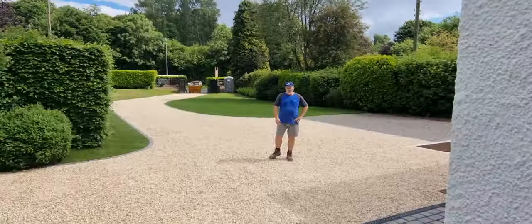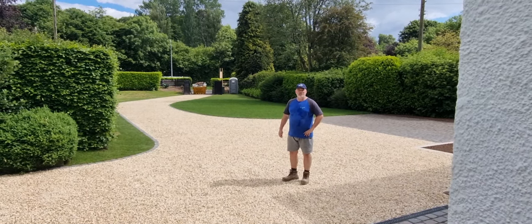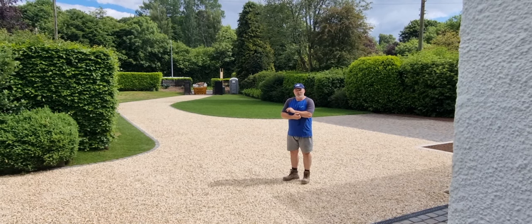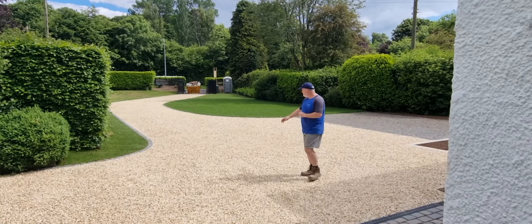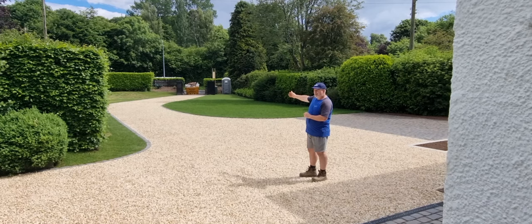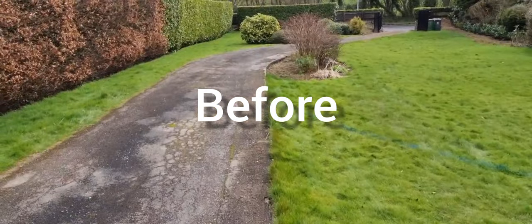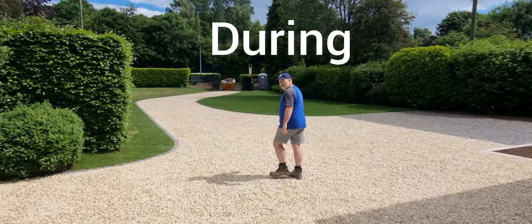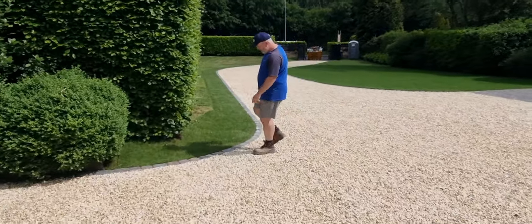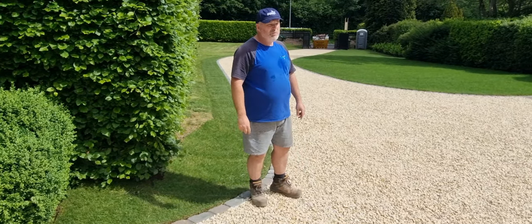and we'll show you the driveway with the chippings and the decorative stone. The driveway we've put in the decorative stone, Brad's showing you now. If you remember, we've put in the driveway crate system underneath that from Ibstock. They work really, really well. So that went in, we got an MOT base underneath and a decorative stone with a weed membrane on top. So there we go, 26 ton in there, and then we edged it. If you come close, Brad, get a close up on there. We edged it with a Drivesys paving system, which matches the one you've just seen, and that goes as an edging all the way around to the bottom of the drive.